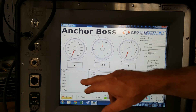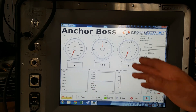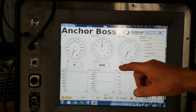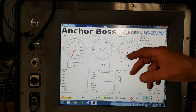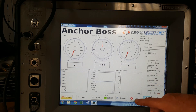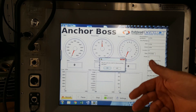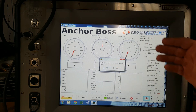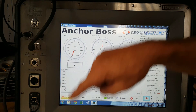The usual inputs are here — job, installation, dive number, ROV, client and so on. We're giving water pump flow and hydraulic flow all in data downstream. It gives you an idea of what's going on. This is all graphed in real time, and through the pressure and flow these are all time charts. So you can look back at the job: we saw a spike, let's go back to 11:42, and you can see all these parameters and what was going on throughout the job — any anomaly during the install or removal of the pile.